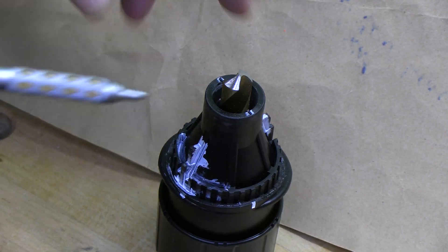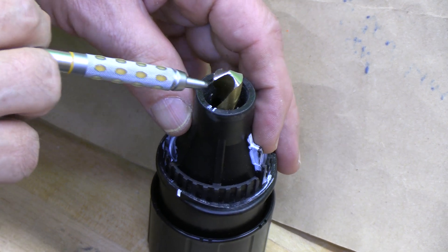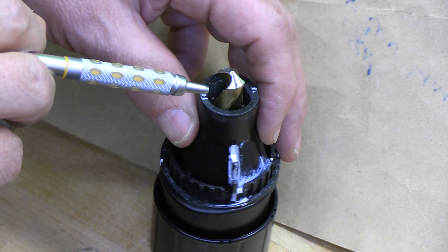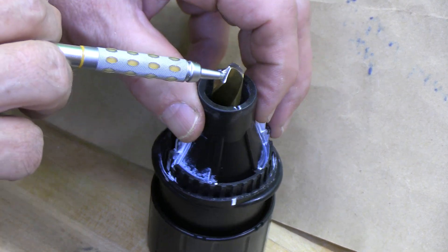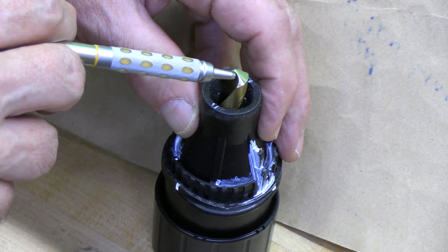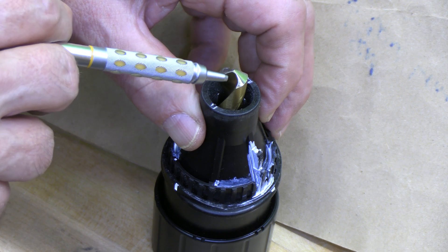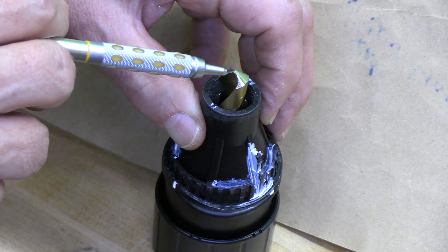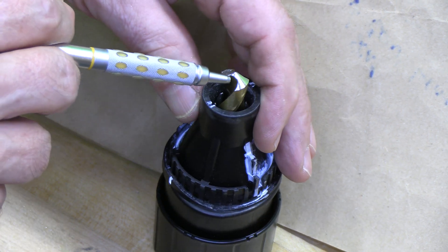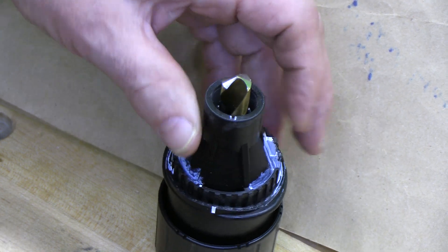You'll notice it's silver because the titanium has been ground off — but not at the cutting edge. Right at the cutting edge is where the action is, and you can see the chisel point. The grind has removed the titanium coating there, but right at the edge is where the sharpness is, where all the cutting is done, and where the titanium coating protects the steel and allows for a better cut because it's very hard. And there's a properly sharpened standard drill bit, titanium coated.